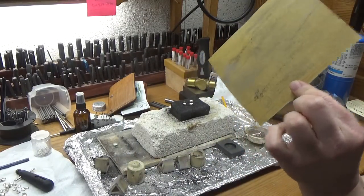Just as long as they aren't touching, you're good to go. I always start heating from the side closest to me because the heat's going to travel that way. I'll heat it up a little bit until I see it starting to oxidize — this is Sterling, so it'll oxidize pretty quickly. Then you take your Prips Flux and I am very, very generous with this stuff. Then I heat it up. You see how it turned white? Now it's going to turn either kind of a yellow or a clear. Prips tends to turn yellow. So as soon as it flashes past that white point, you're good to go.